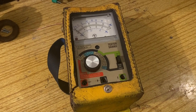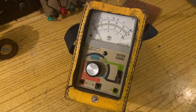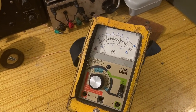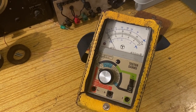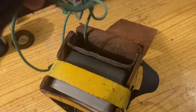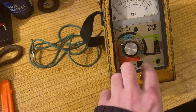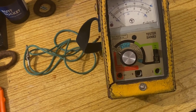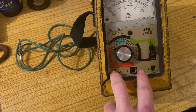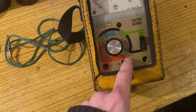The tangent will be me making probes for this, because I want to make use of it. I need some banana plugs or wander leads, and I need to get some probes as well. There was this thing that came with it which I think is original, but the plug's broken off at the end, so I'll have to make that into something. It has three terminals because you can test between earth and the two pairs of your telephone line - you can do reverse polarity, check the A leg and earth for shorts, B leg and earth for shorts or leakage.